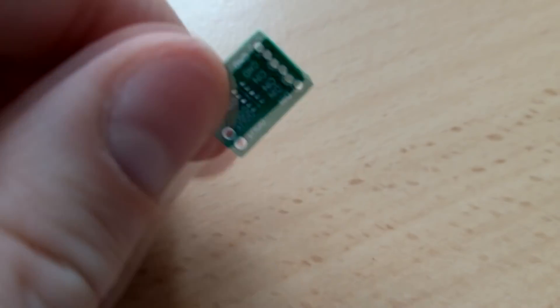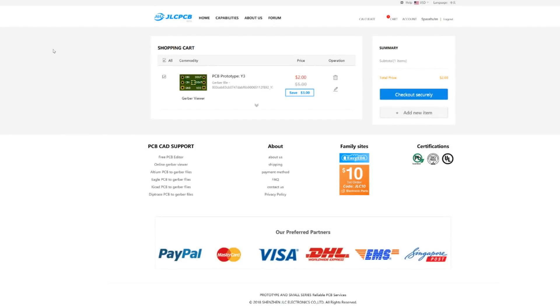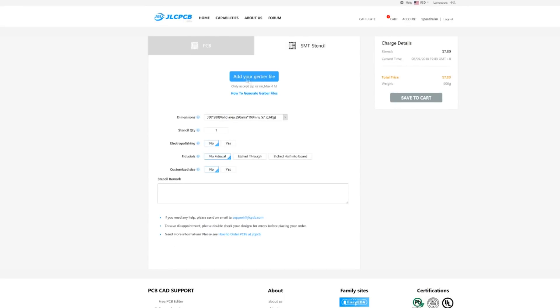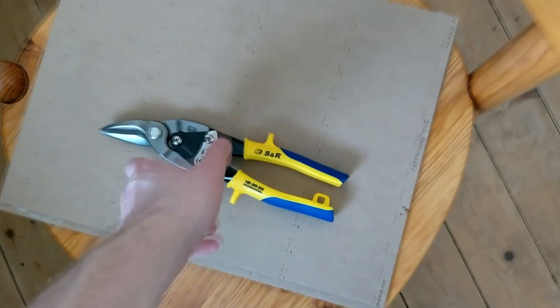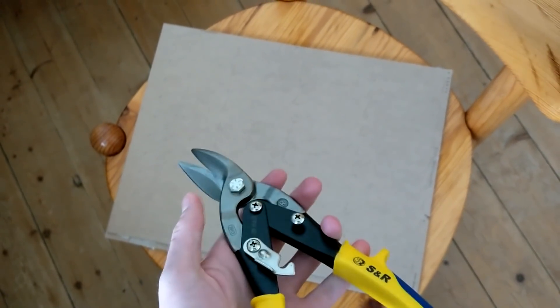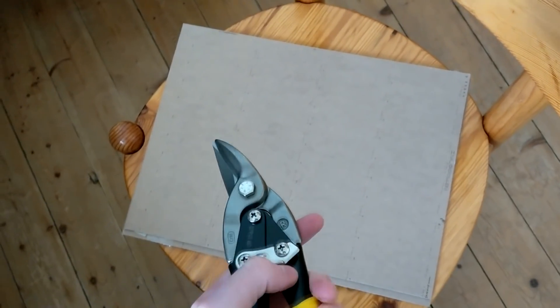I went and soldered the first of them. I'd never soldered something so small. The LEDs were working with an example sketch but I thought I need a stencil. So I went back to JLCPCB — under the SMT Stencil tab you can upload your gerber files and order a stencil. I had to buy a tin snip, which is basically a fancy scissor to cut this metal stencil — and there it is, with just these tiny little holes.